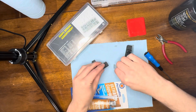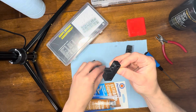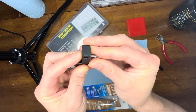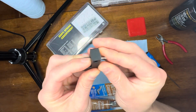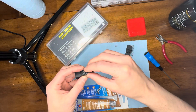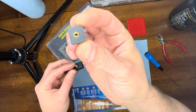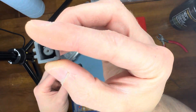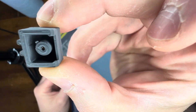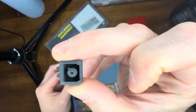What I wanted to show you here is I have two different cups and two different sized springs, so depending on your setup you can change the travel height based on that. So on this first one, this is an M3 by 20. One of the things you want to make sure is that your screw fits in the hole and slides properly — there should be no resistance because that's what the cup is going to do. So you pop that in and put the cup on top. I also forgot to mention that I've already pre-done the heat sets which go in from the bottom. You can see now they no longer go through the top.